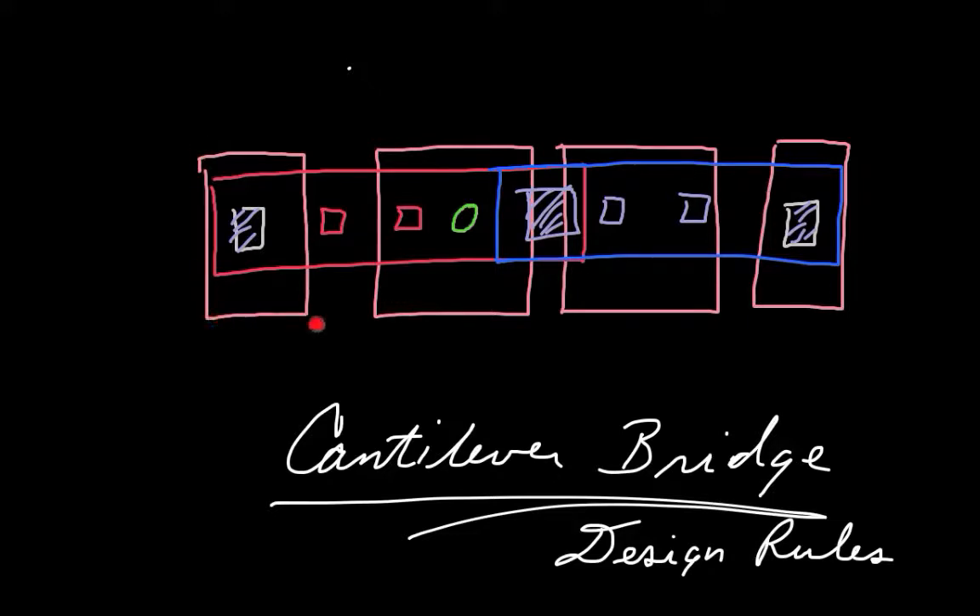If you look here, these salmon colored structures — those are poly zero, exactly. So what's the purpose of poly zero? It's the ground. So this would be a ground and this would be a ground like we've discussed before. And these could be actuator plates. You could put two different voltages here and get that double cantilever to do something funky.